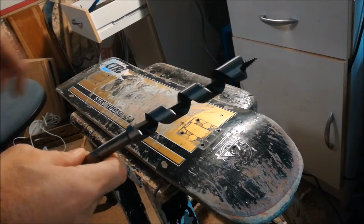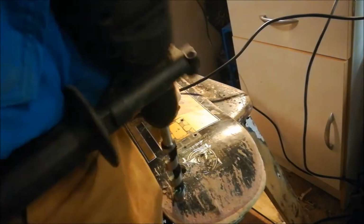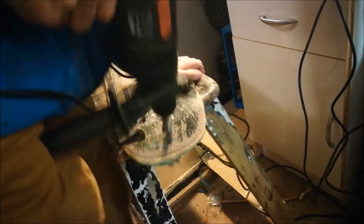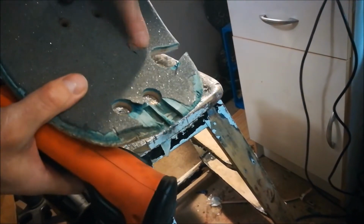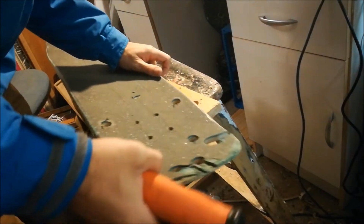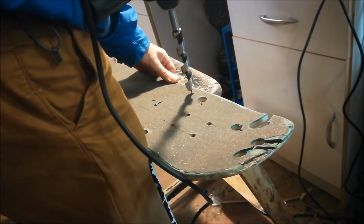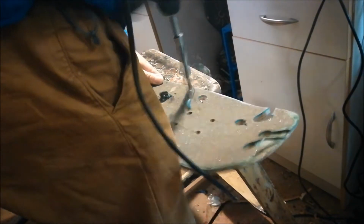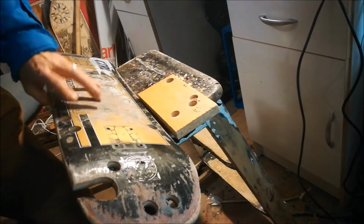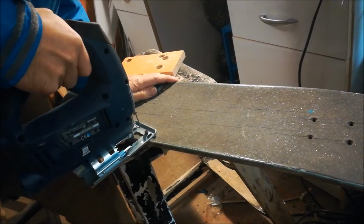I use a drill bit around the same size as my ring and drill the board. To avoid the wood exploding behind, I need to add another piece of wood and press the boards together. Now I can cut around with my jigsaw.